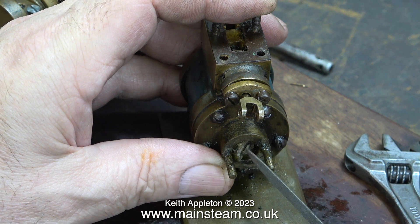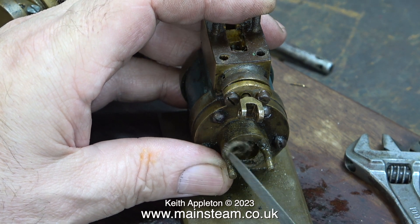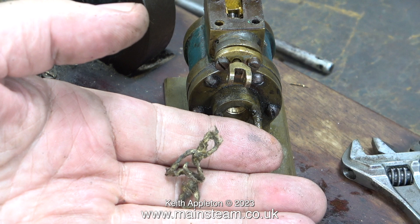In this clip I'm removing the valve packing and this is really very old and very dry — it fell to bits as I pulled it out. When I initially repack the gland I'm going to use a couple of o-rings. Why use more than one? Well, it's something to do with the tolerance of the manufacture. Even fitting two o-rings may be insufficient, because all the fits on this engine are what could be described as rattle fits.